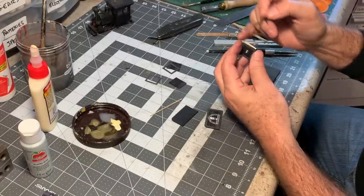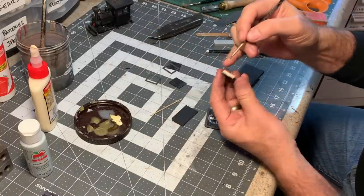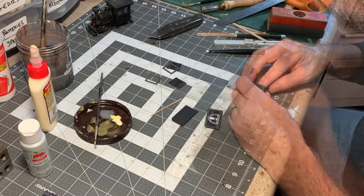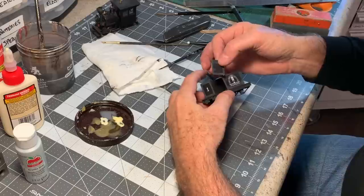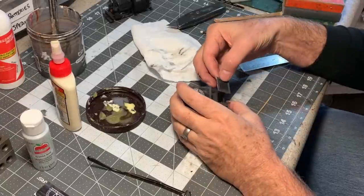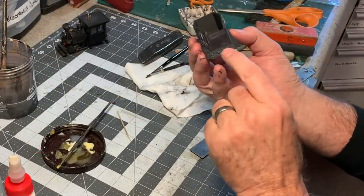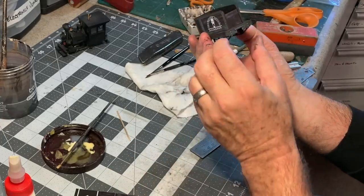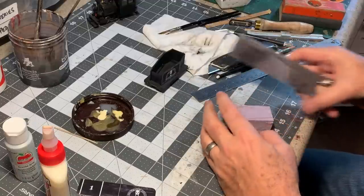I'm going to start assembling this now by adding the rear panel to the deck first. I've added a little 6x6 brace down at the bottom to help it stand up straight. And then I'll put these side pieces on next. Now, this should fit really nicely right in between. Now the last panel, make sure those edges meet up. Now I made an end piece and glued it in place, and this is just made from a piece of the leftover car sides.